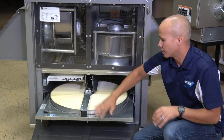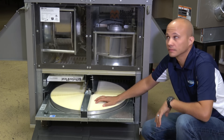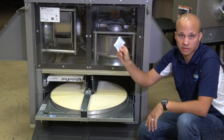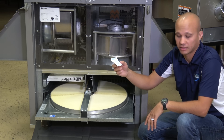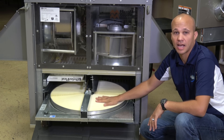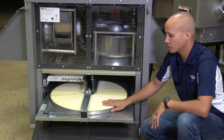This is our heat exchanger — a wheel-style heat exchanger. It's made out of plastic and has a silica-based gel impregnated onto it. You've probably seen these types of packets before — silica gel, do not eat. You'll find them in electronics boxes, leather shoes, things like that. The purpose is to keep moisture neutral inside the packaging. The same kind of material is impregnated on this plastic in order to transfer moisture. It can absorb or release moisture depending on which airstream it's in on a given season, and that all happens automatically.